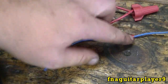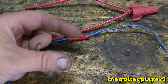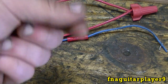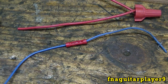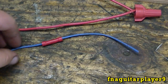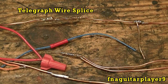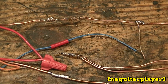There are other types of crimp connector splices too. There are blue ones that can hook up to three wires — they work similarly but have a plastic piece that comes down on top, and when you push it down with regular pliers, it shoots a piece of metal inside that penetrates the wire. There are also quick-disconnect terminals with both ends that slide into each other, which works well for something that needs to be taken apart again later.